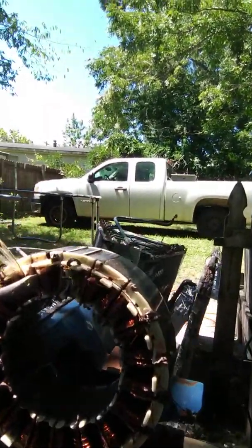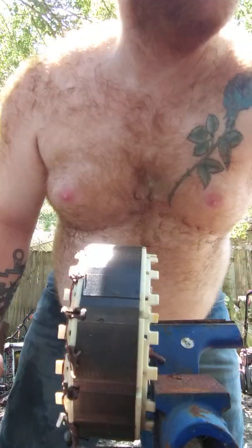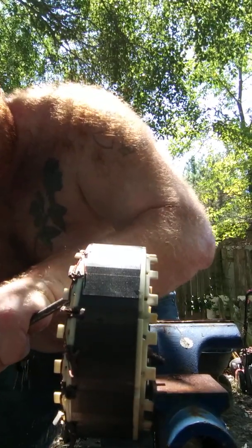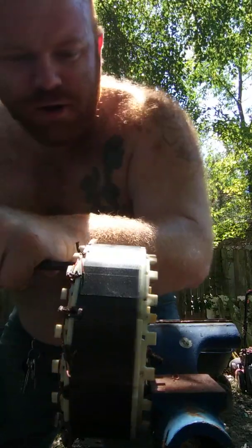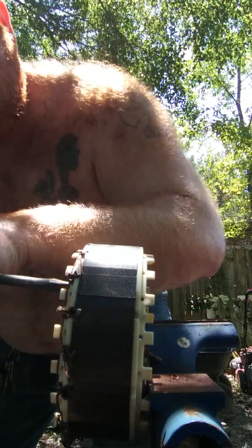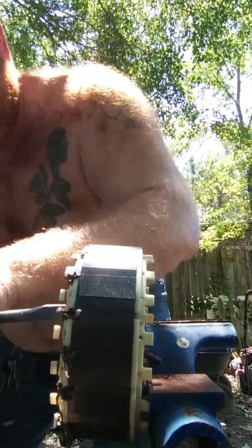Screwdriver. And you take it on the side closest to the opening and stick it in. Once you've got it locked in, take a hammer and tap your screwdriver. Pulls right out. Now sometimes you'll get that plastic insulation, it just pulls right off. There's three. Always move closest to the hole. That way your screwdriver can go all the way through without any fuss. I'll pick that one up in a minute. And they just come right out.